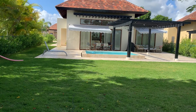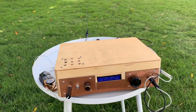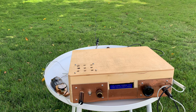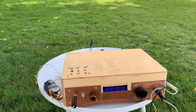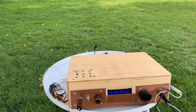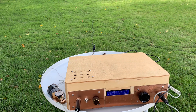I've been having more luck on CW with this thing. I think when I get back to the States, I'm going to take this back with me and replace the IRF-510s in the final with some of these Mitsubishi RD6 chips I've been hearing about. I use one on one of the rigs — it gives a better response at the higher HF frequencies. The power out with the IRF-510s falls off pretty significantly.